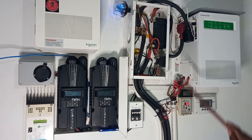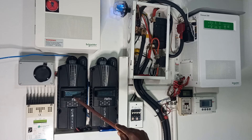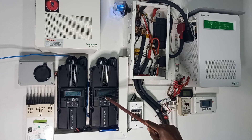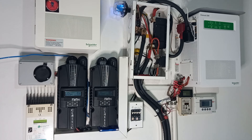This is the Classic 150 SL and this is the Classic 150. The SL has some timing issues so it's not showing today's full power, but it normally runs close to four kilowatts. The other is showing 4.4 kW now, which is normal. We have them in a 'follow me' setup — if you have two Classics of the same voltage, they can follow each other. It's very important when running multiple charge controllers to have them set up to follow each other so the batteries are maintained properly.